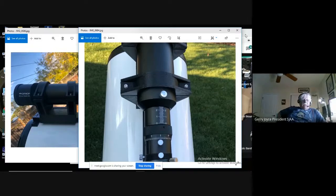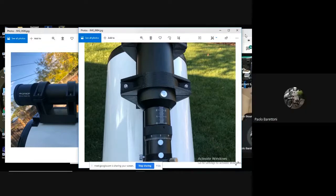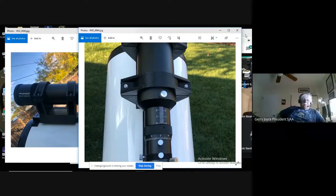How did you do that? You put an insert in there to capture the screw? There are inserts, let's say, hot inserted. You insert that with a soldering iron, in order to fuse the plastic around, so they become embedded. So you have the brass insert where you screw the screw. Very cool. Solved a big problem.